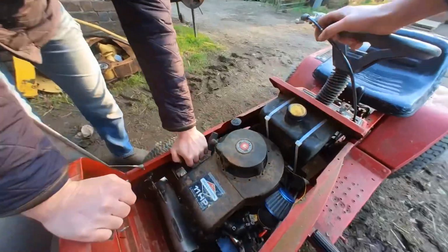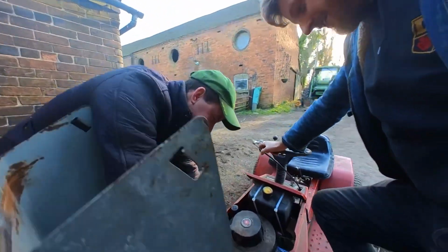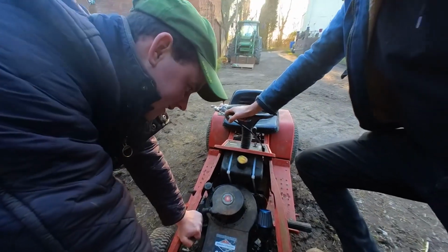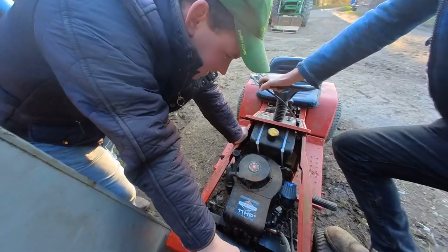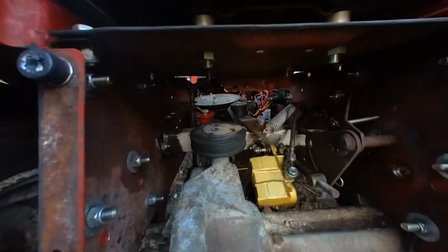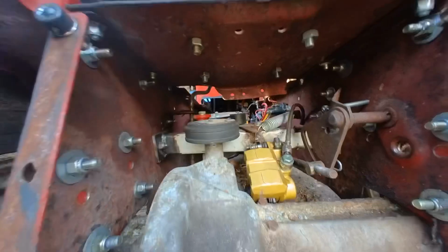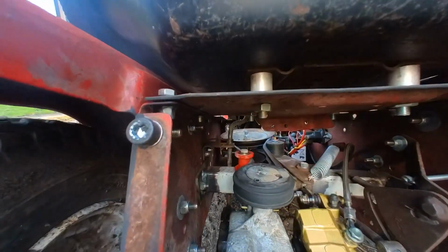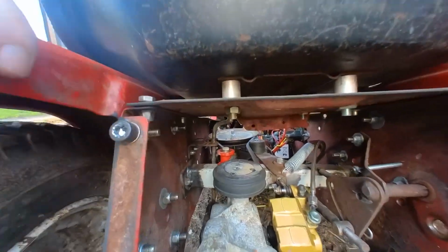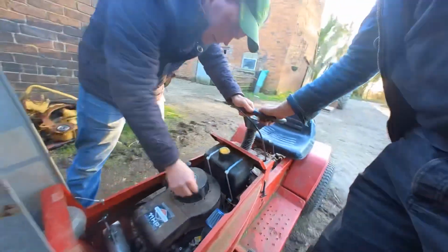What do you make of it? It went well. Did you have a go? Yeah, I'm the only one who's had a go, and I've only gone 30 yards. Not winning any races, am I? But that pulley setup seems to be about right. I'm happy with that, it's not too fast. The belt and everything seems right. I've had to weld a spot on the top because the clamp wasn't clamping on that split pulley, that taper block pulley.